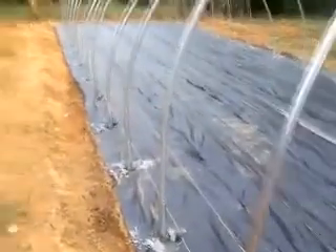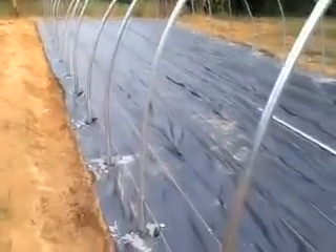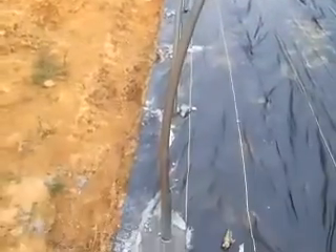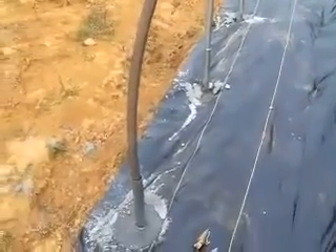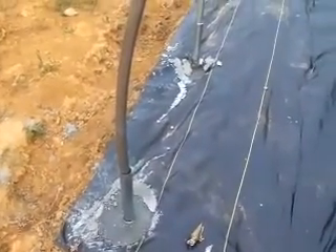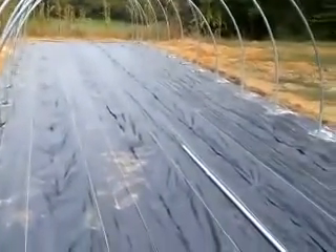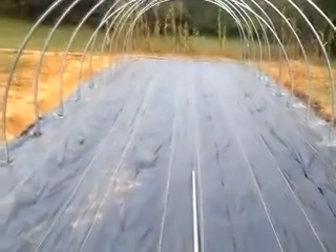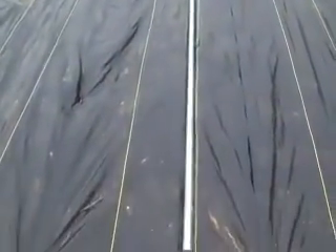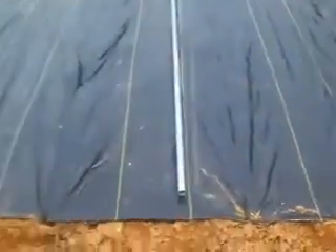I will screw those in — one foot in each post. I am going to do the left side first. It will get screwed in and then I will pull everything straight. I want to mark it with a piece of tape — one foot that goes down into the footer post. Then I will mark my right side and pull it straight. Then I will take my time and put one bar that runs all the way down the middle. I will probably put it in with plumbing tape, which is a metal tape that comes on rolls and has little holes in it. I will also connect my end walls with plumbing tape.